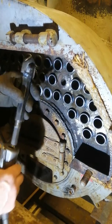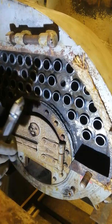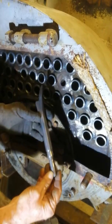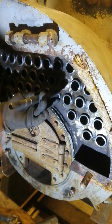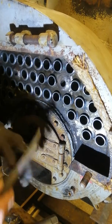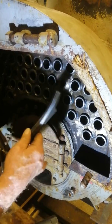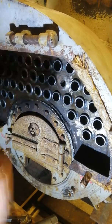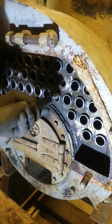So when it's in the Boyer gun it doesn't turn, and when you turn the whole gun you can actually manipulate this around the tube. The other chisel is this type — it has a plain end, and we can rotate it with our fingers when we come to finish inside the gun without having to turn the gun. So we've got a two-prong operation: first we're going to go 45 degrees with the first tool, and then we're going to finish with the second.